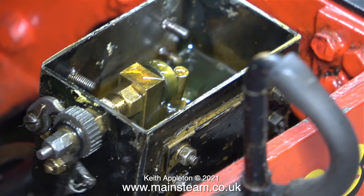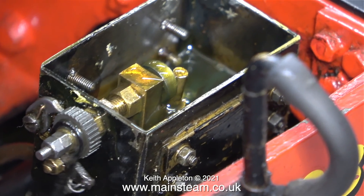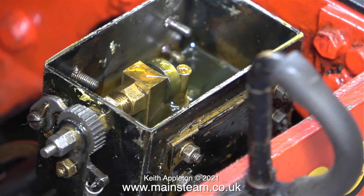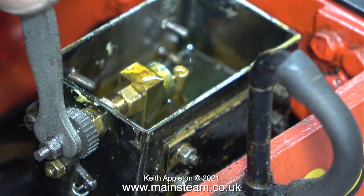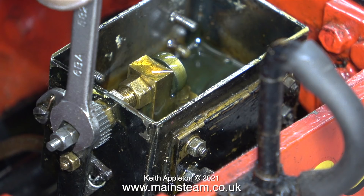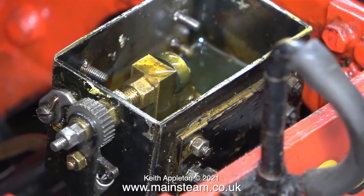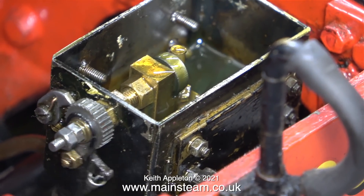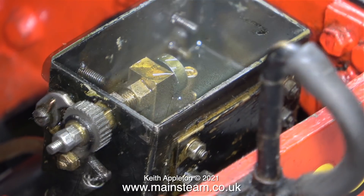I've slowed the video down so you can clearly see what is not happening — even though the lever is moving back and forth, the teeth on the ratchet wheel are not clearing the pawl. There is some adjustment with the two lock nuts to increase or decrease the pressure that the operating arm puts on the ratchet wheel. I slacken off the lock nut and then slightly tighten the inner nut to press the operating lever more firmly against the ratchet wheel. I ran the engine for much longer than this to confirm that the ratchet wheel was engaging the pawl at every revolution.